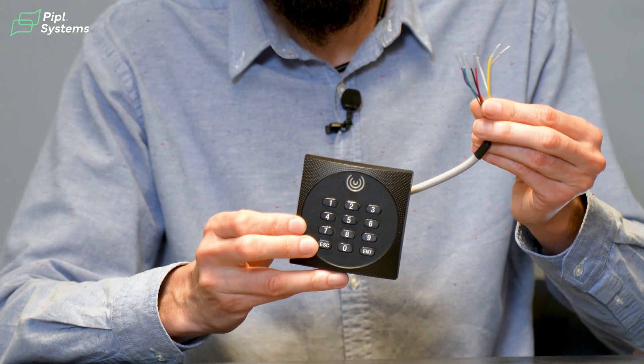So the main question of this video — what is actually better, Wiegand or OSDP? Will they coexist for a while? Should we use one versus the other? We see that these two technologies will be alive for a while. Access control is not changing overnight. There are a lot of current installations, and there is a way to reuse Wiegand wiring for OSDP or RS485 in most cases. Though RS485 wiring is more difficult — you must connect readers in a chain, terminate the line with resistors appropriately, and there are more issues. If that line gets compromised, it affects all readers on it.